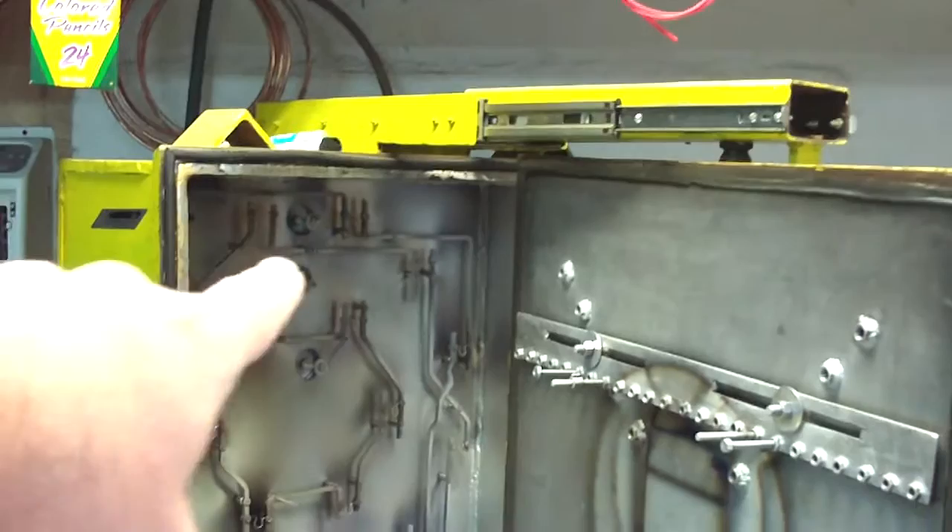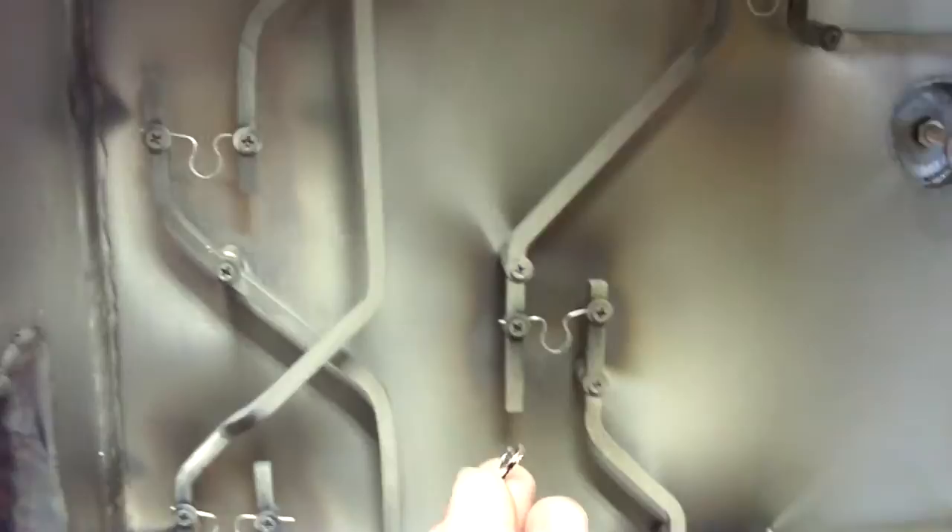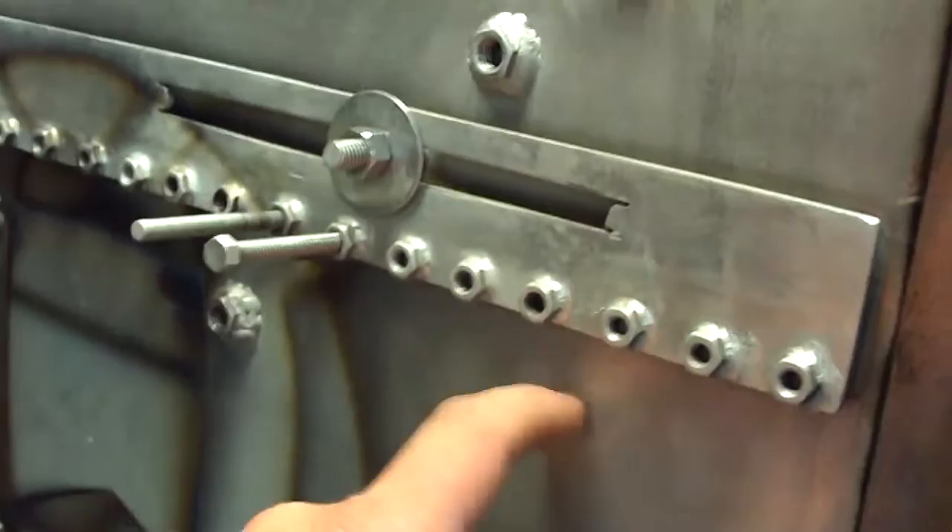On the back wall of this metal box are some electrical conductors. I've got 18 of these tungsten heating elements. You take a little piece of aluminum foil — I've used Reynolds Wrap, but this is specialty aluminum foil — and I pinch it onto this tungsten, and repeat it for all 18 of the tungstens. I pass a DC voltage through the tungsten. It makes it glow red, just like a light bulb tungsten. The aluminum melts, turns into a liquid, the liquid starts to boil into a vapor. The vapor expands in all directions because there's nothing to cool it back down until it hits something solid like the wall or the mirror sitting up here, and it instantly condenses back into a thin optical film of aluminum. Like all this nice silver — that's just regular steel, it's just got a bunch of aluminum coated over it over time.